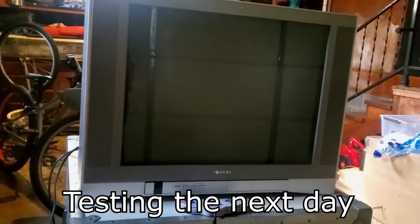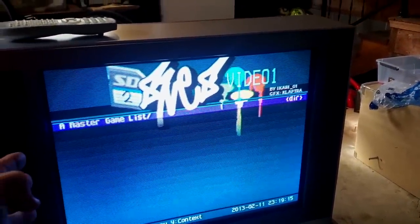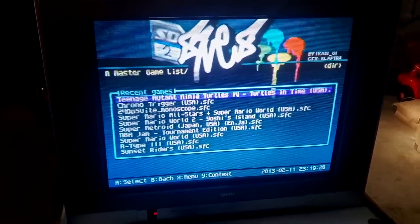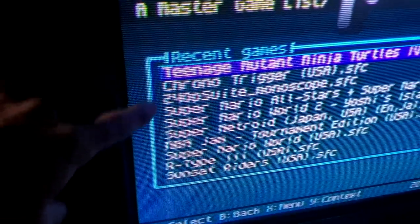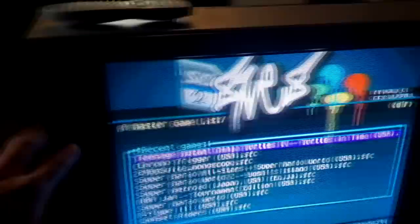Our Toshiba has been powered off all night and it's early morning. Powering everything on from a fully cold start to see if any distortion happens along the edges — I still think we'll need some warm-up time. The screen comes into place and looking at our test pattern, that dead cold CRT is not having any wiggling at all. After the set has been running for a while, I still have a consistent, clean line and didn't have a single time where it glitched — no brightness issues, it ran perfectly.